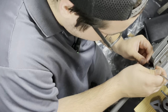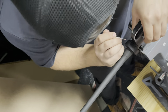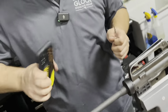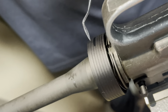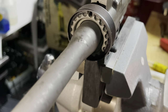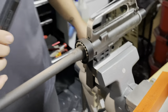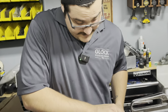The spring is a lot easier to spin around in the retaining clip, because that retaining clip is on there pretty tight. It might be hard for you all to see, but if I use my phone flashlight, you'll be able to see the retaining clip and the spring. There are several coils of the spring underneath the delta ring here, and now I've got it pretty much lined up with the gas tube hole on the upper receiver. But the problem is I've got to get it lined up with the barrel nut as well. I'm going to torque it down and see where we're at.